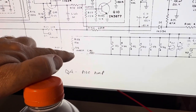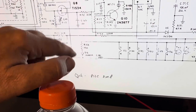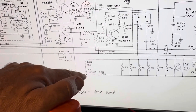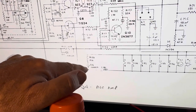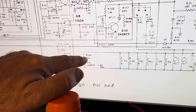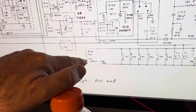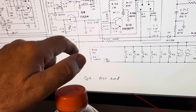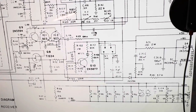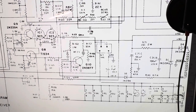This is the power supply for the PTO VFO. I haven't checked it for correct voltage — it's probably low. This was getting fed 12 volts, rectifying through a half-wave rectifier, and now it's getting 6 volts so it's probably on the low side. But the PTO VFO is working — how well, that could be questionable. Anyway, that's all we did here — I've got some fixing to do on this thing, but that's how the conversion worked.